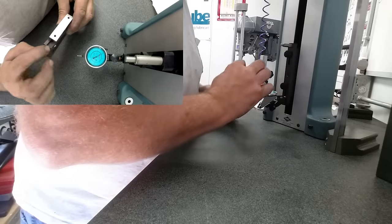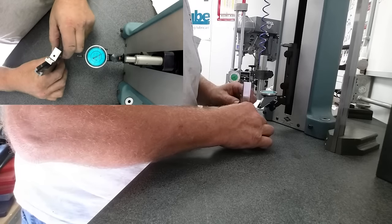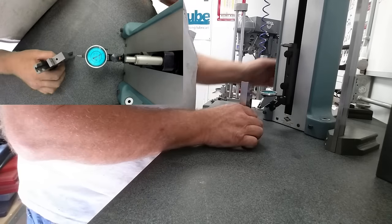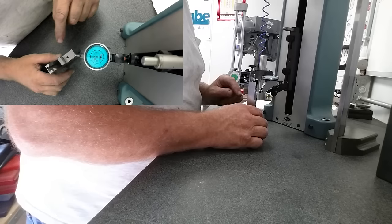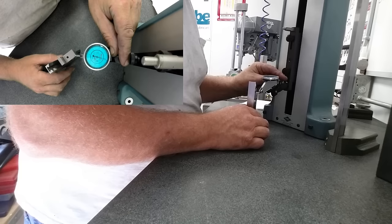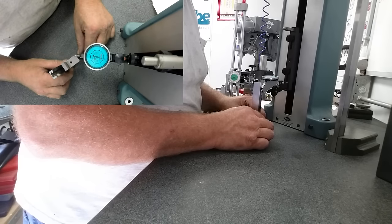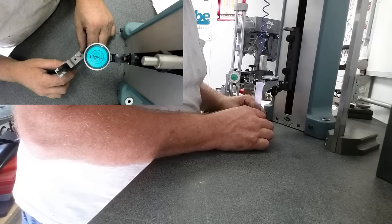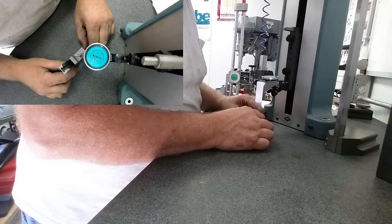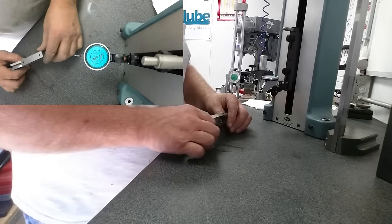Tenth side to side on all of them. So these two surfaces have pretty much the same errors, and I think it's just this little V-groove that doesn't land in the same spot every time. Let's check this fella with the gauge standing up, find the center of our V-groove, and check it. This is the one that was seven tenths before. We're within a tenth there. Then a tenth there. Over here in the corner — yeah — a tenth there. So this thing's a pretty accurate gauge. If it'll hold a tenth, I'm pretty happy with it.